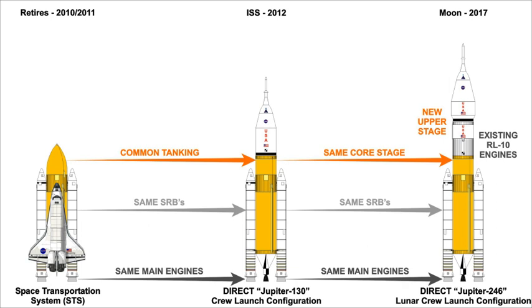For heavier payloads, a proposed Jupiter upper stage would be added atop the tank structure. For extraplanetary expeditions, the Jupiter upper stage would serve in a role similar to the Earth departure stage planned for Ares V. DIRECT purposefully specified existing components for their launch vehicles, but noted they could incorporate improvements such as the more powerful five-segment SRB or the J-2X upper stage engine, had J-2X development not ended partly due to the cancellation of the Constellation program.